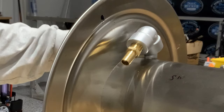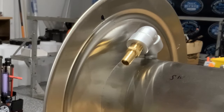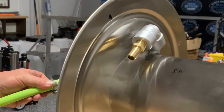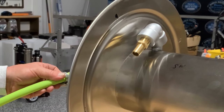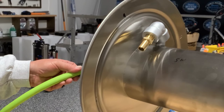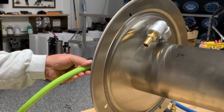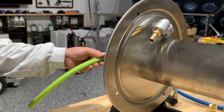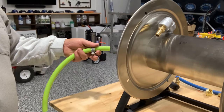Make sure your brake is adjusted so you don't free spin it when the hose is coming off. This part from the swivel — just like a pressure reel — this is your whip hose going to your pump or wherever your discharge is: your manifold, blend system, metering device, whatever you're using. Wherever that outlet of your soft wash mix is coming out, that's where the other end of the hose goes.